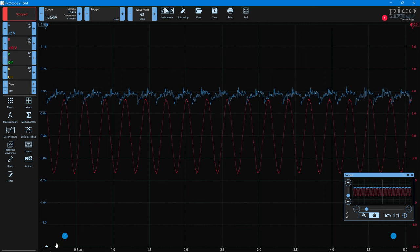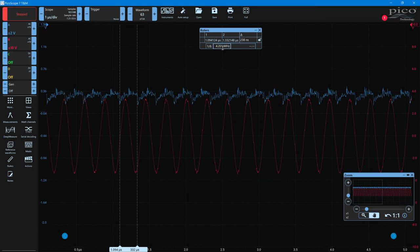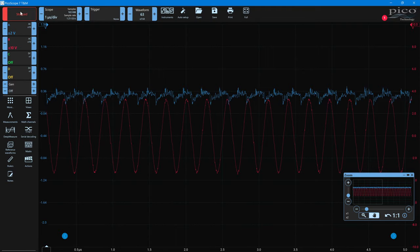They seem to go out a little bit here. So if you notice, the drops are not quite center there, not perfectly center there, slightly off here. So the frequency isn't identical, and in fact, we can probably find out the frequency to some accuracy by looking for these drops. This frequency is about 4.2, whereas the frequency of the red is about 3.5. So it could be that we're looking for a different clock, or it could be that we simply have harmonics and reflections at play, which change the frequency of crosstalk.